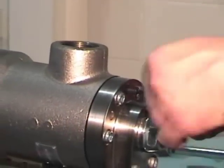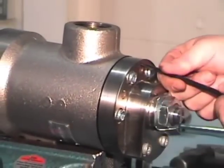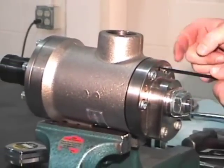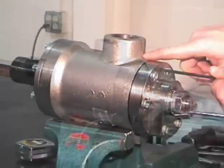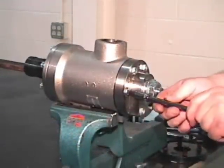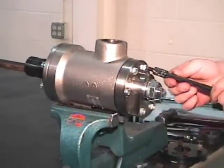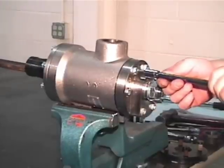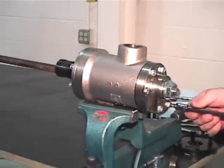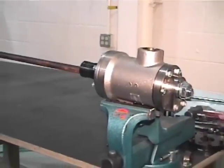There are two siphon adjustment cap screws. Remove the first one. Ensure that the second one is flush with the back of the end cap. Be sure that the two cap screws at 9 o'clock and 3 o'clock position are hand tight. Loosen the ones on the bottom and top. This will allow the siphon to pivot for adjustment purposes.